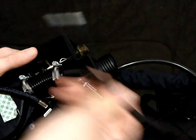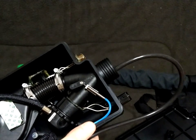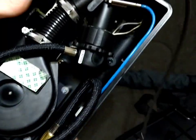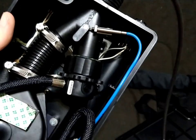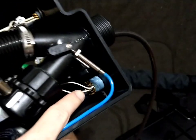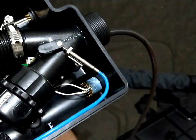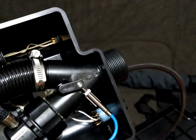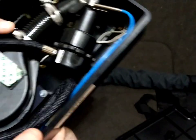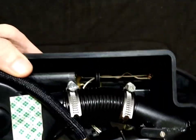Unfortunately, the Avon ones just don't really work well because of the addition of that very odd pressure tube inside the main breathing tube — that's the main downfall with the Avon ones. The Micronel and presumably Draeger ones did not have this. It's literally just because of the Avon compact demand valve in there. You can also see the variable switch used to power on the blower; on some models it would have been three-speed, but this one is single-speed with the additional two speeds crossed out.